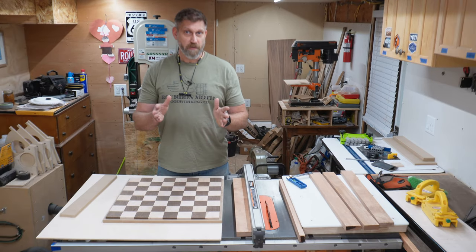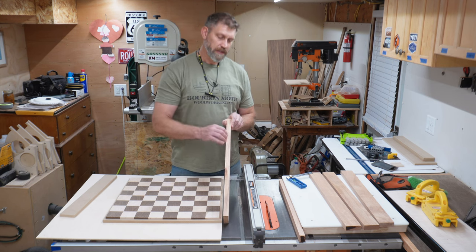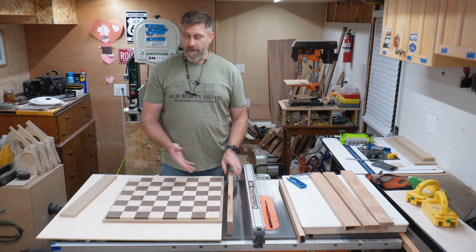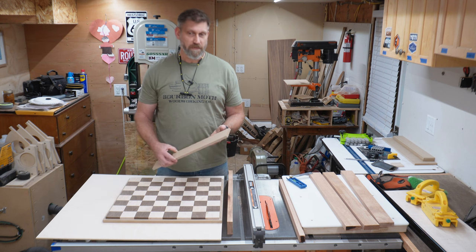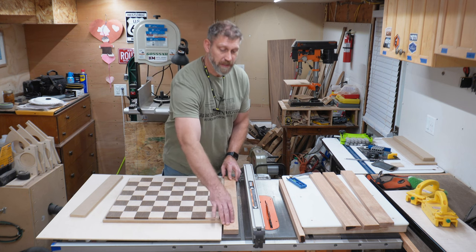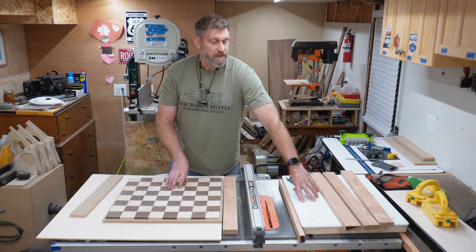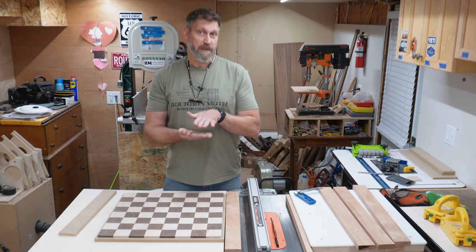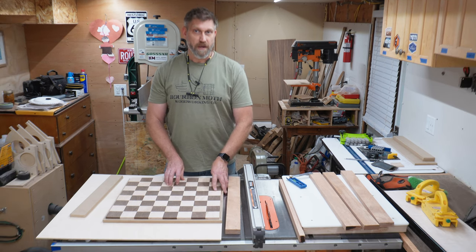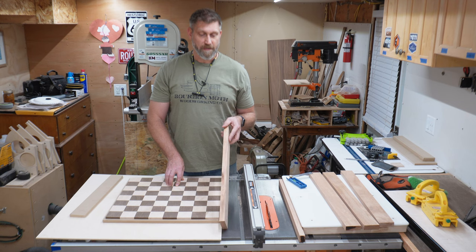So here's my new plan. I'm going to resaw the mahogany, maybe not exactly 1/2, but maybe 3/8 of an inch once it's planed down. And then I can laminate that to more substrate, either MDF or some plywood. And then that would take care of both problems of eliminating the twist by laminating and gluing and making it flat with my veneer press. So that'll take the twist out of it. It'll also make the frame pieces thicker so that I can cut a dado into the side and slide it over the core and the plywood bottom. So that's what I gotta do next, is resaw the mahogany frame pieces.